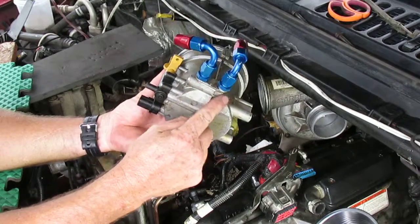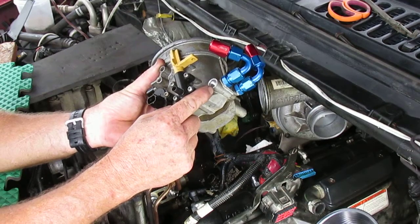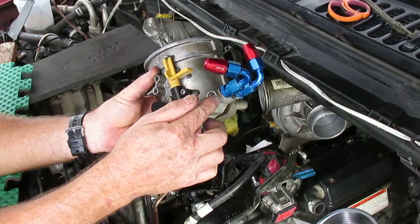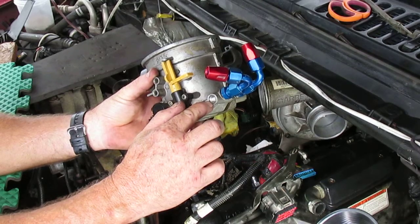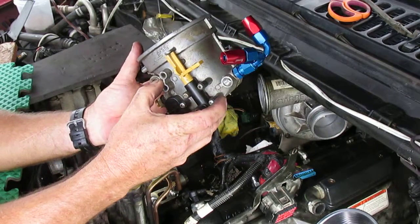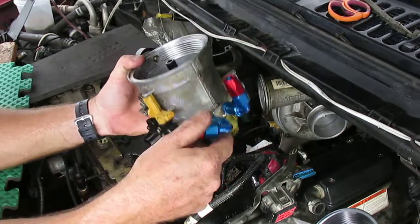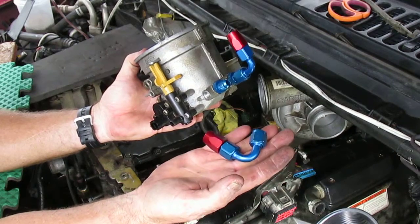You can see this piece here. Now this is actually mainly used as a takeoff for a gauge in there. You can get a special fitting. I think it's a 4 SAE with the O-ring, kind of like the plug that comes out of it. It goes in here. You find them at pretty much all industrial hydraulic hose shops. And you screw that in, and then you get an 1/8 inch fitting to screw your AN fitting in there, because this is actually 2 parts. You have the fitting part here, and this is the actual part that fits on the hose.